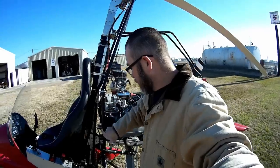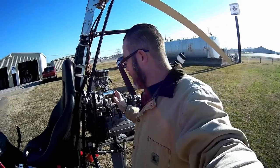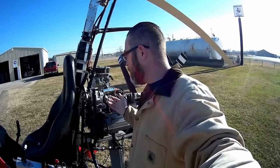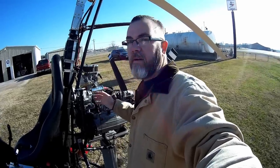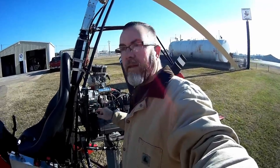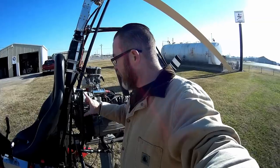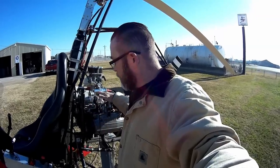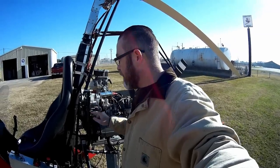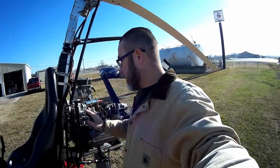I had to make the water tube here. It's very crazy on these Subarus. When you convert it, you don't have all the original stuff. So what happens is it'll collect air and you'll overheat. Or rather, air will not bleed out of the system unless you have a tall pipe that gets above the full water level of the engine, so you can let all the air bleed out of the cooling system, and it's been working great.